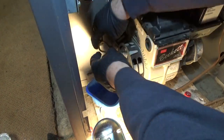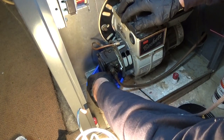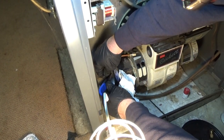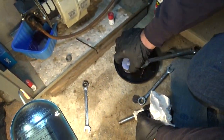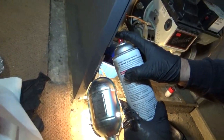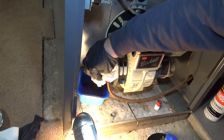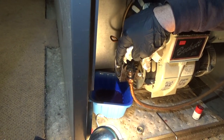There's a little strainer inside here. There's an O-ring in there creating a vacuum on me — there we go. This strainer is pretty dirty, look how dirty that is. We want to clean that. Looks pretty good in there now. There is an O-ring inside here — if they're not leaking, I don't change them, because sometimes you put a new one in and have issues. It wasn't leaking, so I'll watch it. If it leaks, I'll change it. It looks in good shape, so we're going to leave it.